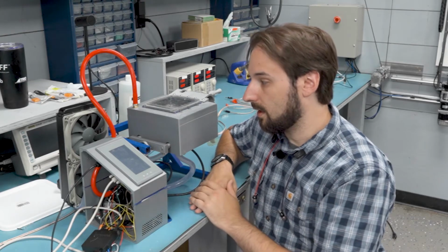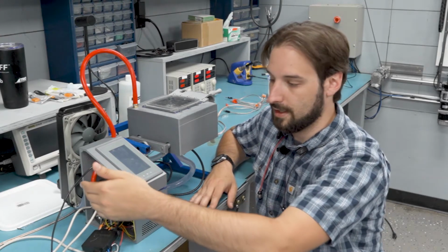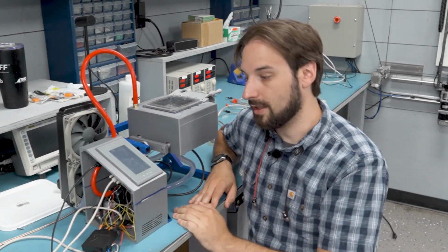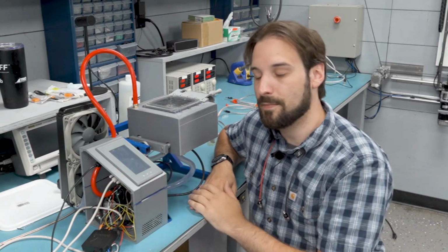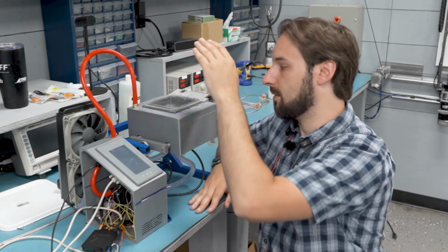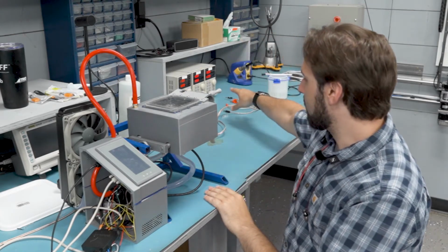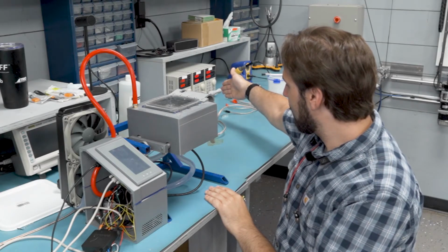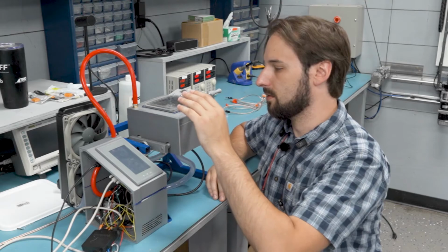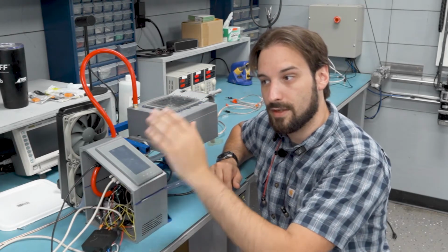And then I've got, of course, our vacuum pump in here, which is going to be powered off of a, it's kind of back in here. I don't think you're going to be able to see that very well. This thing's going to be packed when I'm done. But I've got that thing wired up to an H-bridge. The vibration motor here is wired up to an H-bridge. And those are going to be powered off of one power supply right here in the middle. And then I've got another H-bridge to drive the Peltier devices.